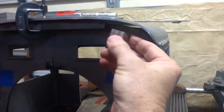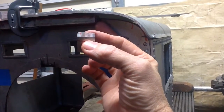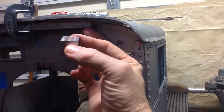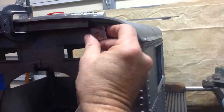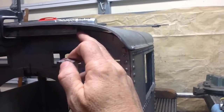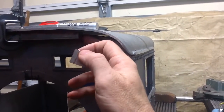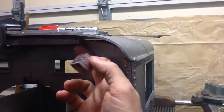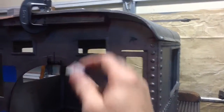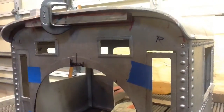The bar is spaced out about an eighth of an inch from the front of the cab — that'll give it pivot room and clearance for the bottom of the bar. You want the cab roof to be able to swing further out from the cab face. If it's pivoting very close to the cab face, that limits the amount of material you can have on the back side of your hinge bar. Looking at the Mikado guy's photos, he's rounded his — I'm not sure if he allowed for any space there, but a little bit of space will save some trouble in the long run.